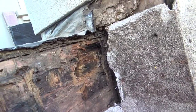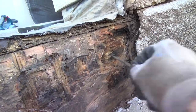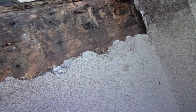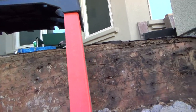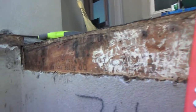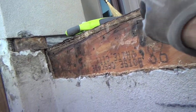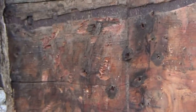It looks to be more than three quarters of an inch thick. I can't go any further than that — I've already dug out maybe three eighths of an inch. I am making the decision that this board is okay; it's not spanning anything, it's on top of a wall. I'm not replacing that. I even poked along in there — it's okay.